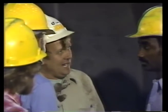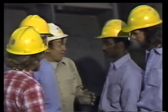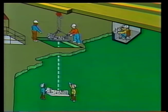Placement of the crew is very important for this job. Along the way, visibility will be limited. Every crew member has to know his part of the job and know the signals used for crane operations. Norris and one helper will guide the load as it travels above the floor. The man giving the signals will be in full view of the crane operator at all times.